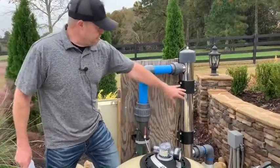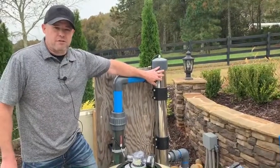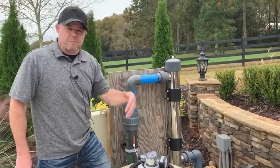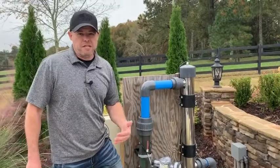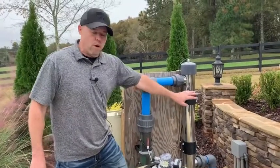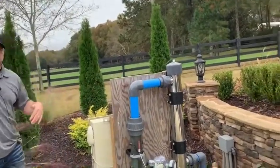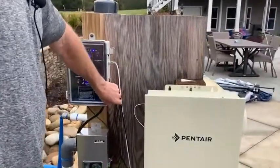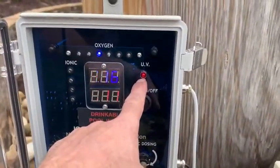Over here we've got the high-exposure time ultraviolet light chamber. The light bulbs will need to be replaced on a regular basis — they're rated for about 10,000 hours of usage, but that depends on how many hours per day you run your system. Generally speaking, for most pool owners they're going to last around one and a half to two and a half years. The way you know the UV bulbs have stopped working is over on the control panel there's a light that indicates the UV is on, and that light will go off when the bulbs are bad. So if you see that light off, it's time to replace the bulbs.